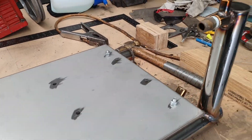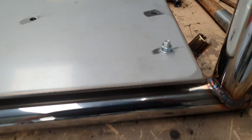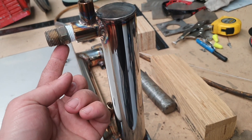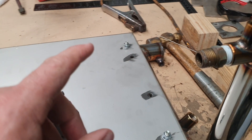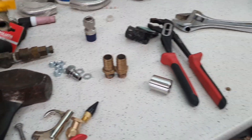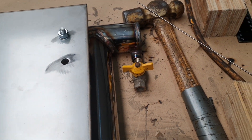It's raining again, sorry for that noise, but we've got all of our bungs fully welded in now. Air is going in that one from the compressor, little bugger down the bottom here, and I've welded this bad boy in. It's an adapter that doesn't want to come out in here. So you've got air in from the compressor, out from the tank, into - you've just seen me playing around and putting the filter on. From there it'll go down into the bottom of the charcoal filter, which I haven't built yet. And this one down here will be as simple as putting a tap in it - that's the drain bung with the tap, ready to go.